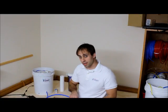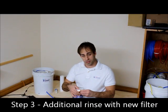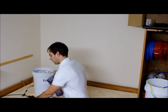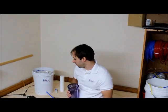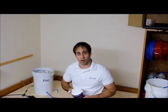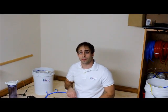Then you're going to move on to step three. You are going to take out your pre-filter casing by removing the push fittings, press the lock collar in, pull the tube out, open up your pre-filter housing, remove the dirty pre-filter, and dump out any residual sap or water. If it's dirty in there, clean it out with clean permeate water. Then insert a brand new pre-filter. Once you insert that brand new pre-filter, put the canister back into your RO Bucket. Then place the intake suction strainer back into a new batch of clean permeate water — about five gallons — and give it a second flush with the new pre-filter, five gallons again with the needle valve wide open.